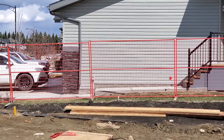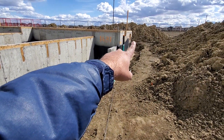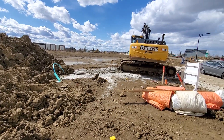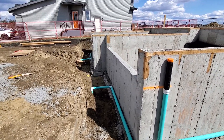I've come back on site now and look what we see — black gooey stuff on the walls. It seems like it's freshly done, I can still see the wet spots. This black gooey stuff is called damp proofing. When we take all this dirt and start putting it back in here it's going to come up to about where I drew those lines earlier. The damp proofing basically prevents any moisture from the soil from getting into the foundation, because moisture and concrete don't go well together.